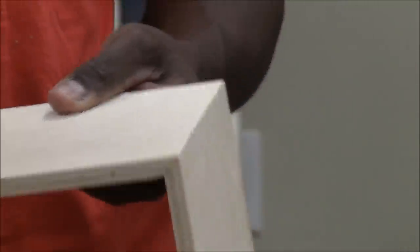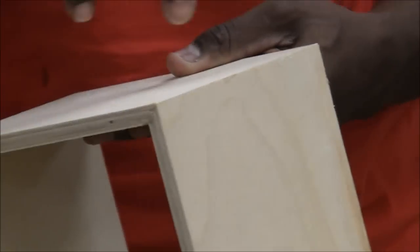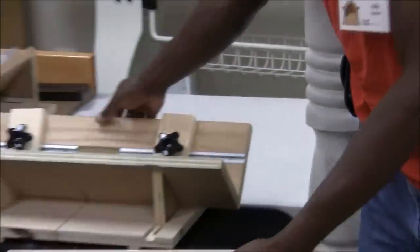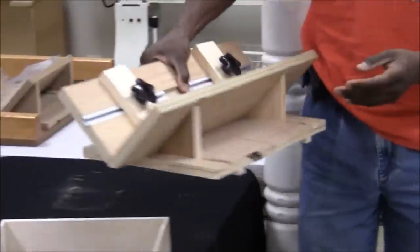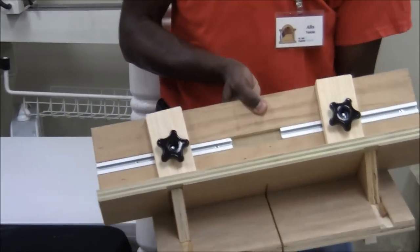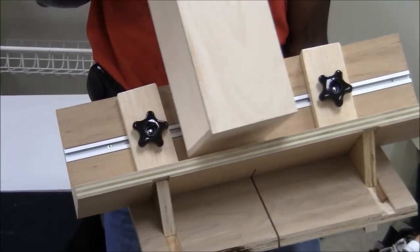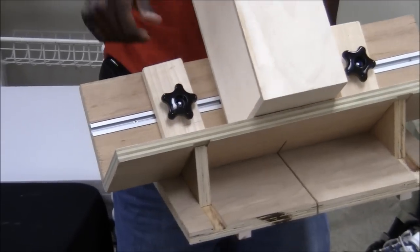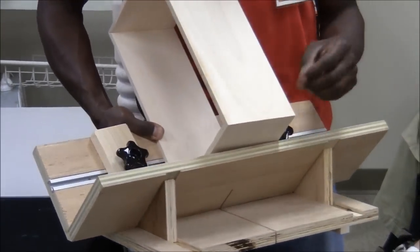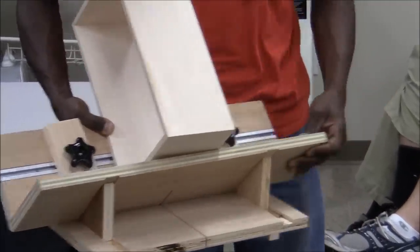the table saw blade, and then after that put small pieces, maybe Purple Heart, in there. To do that, you actually need a spline cutting jig. So this one would sit in my table saw, and I would have the box sit in here, and you just slide it on the table saw, and the saw blade would cut right in there. And you raise it up in order to cut the curve into the box.